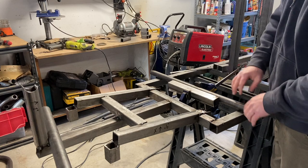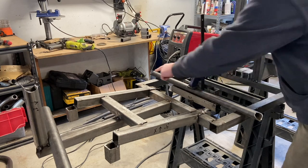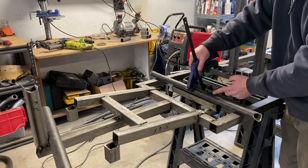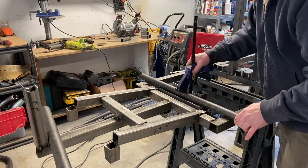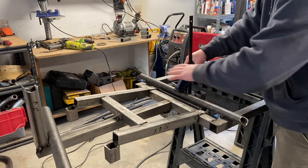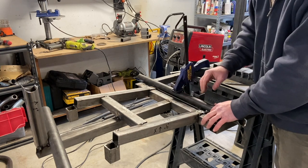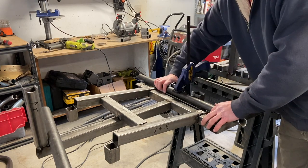What I'm doing is using just one of the long tubes. We know that these rails are the reference for flat bottom, and I've got my jig piece clamped to it. I welded these on the back so it's nice and flush and square with it. I'm just going to slide it into place exactly where it should be, and that way I know the floor is going to be perfectly square. It should be a half-inch gap right in here, so I'm going to set that, weld it back in, and then I can build a floor and know it's perfectly square.